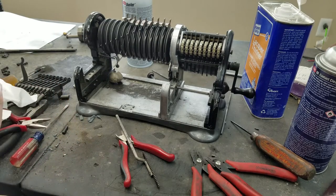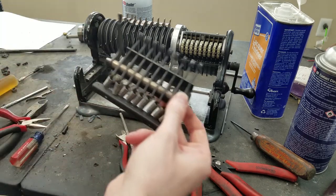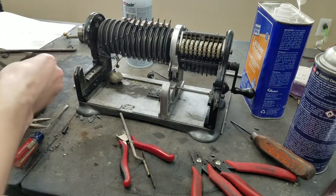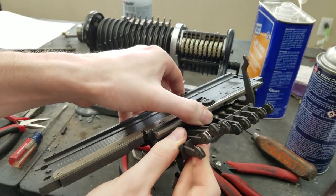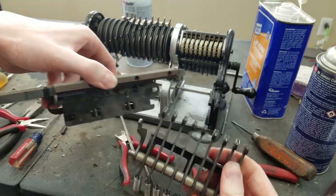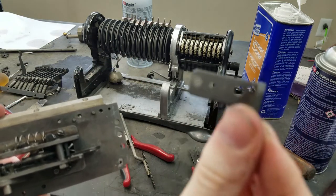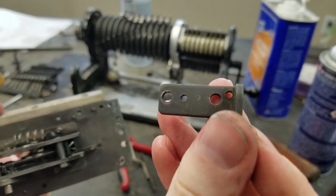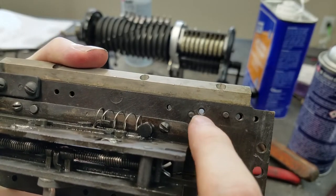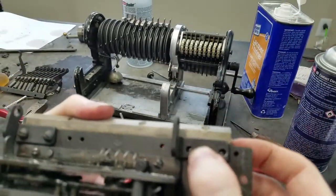Something else I wanted to mention: I was wrong about where these pieces went. I had them down here to hold up this assembly, but they actually go right here, and then this assembly will mount like that and be spring loaded. We'll have to see how it goes on. You can tell because they've got two locating dowel pins and two screw holes, and you can see the outline of the piece on the bottom. The two locating dowel pins and the two screw holes obviously go right there like that.